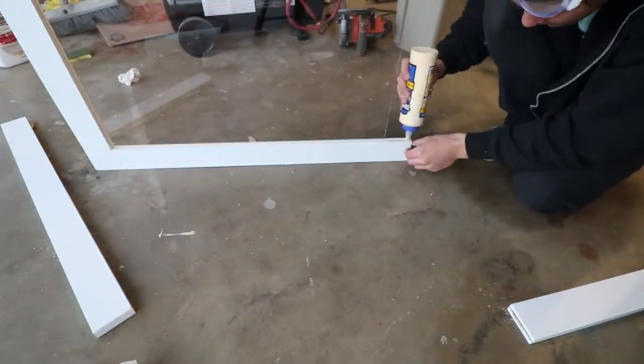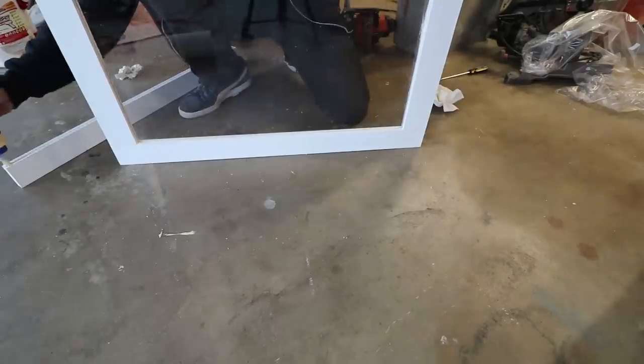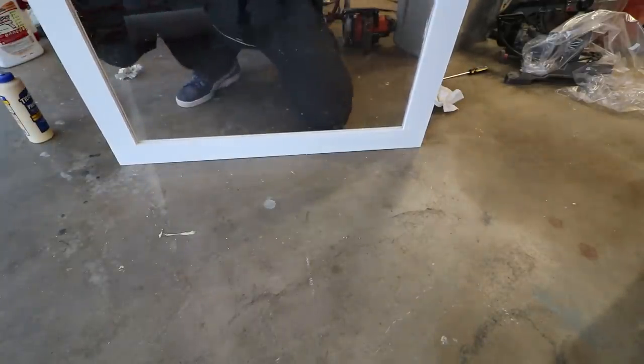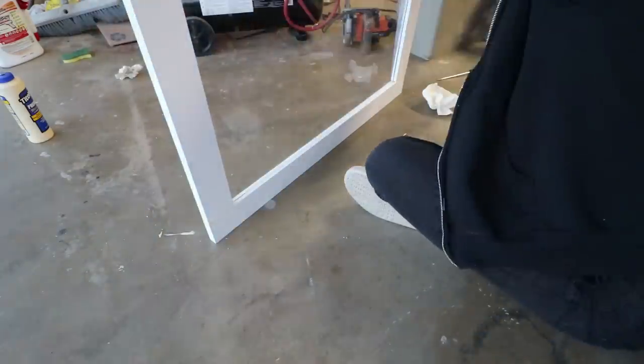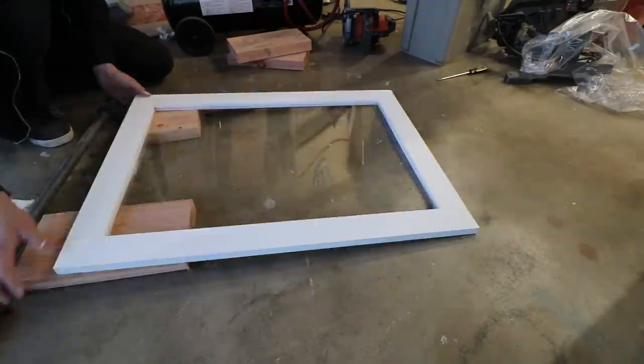The glue-up was a bit tricky. The grooves were pretty snug on the acrylic. I should have made a second pass on them to make them a bit wider. I already peeled off the protective film on the acrylic, and I was trying to avoid getting any wood glue on the sheet. After some finagling, I got the frame together and clamped it until it was dry.